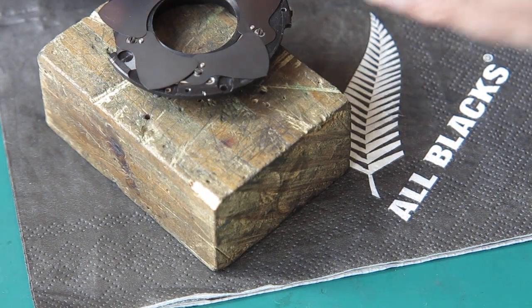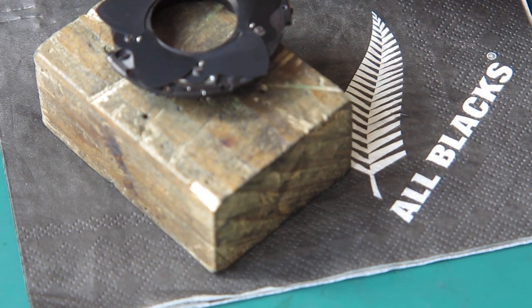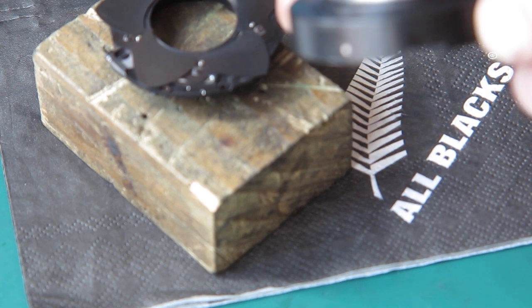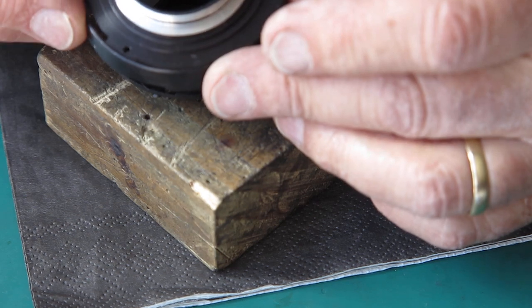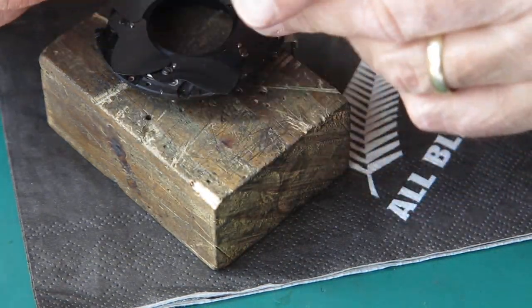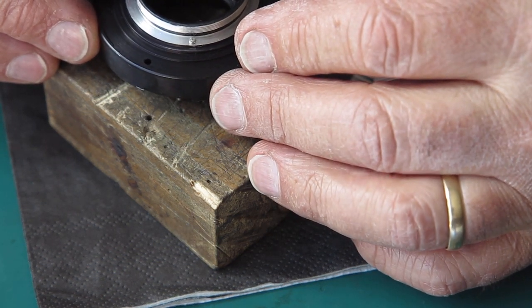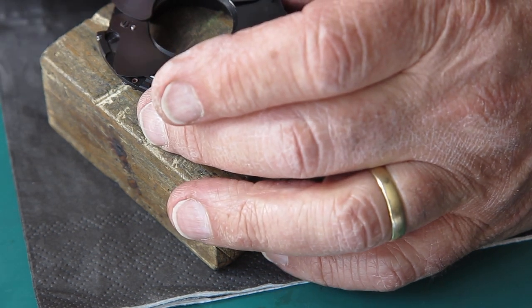Now I've got to get my shutter case, which I've cleaned, over the top of this and screwed into place. So I'm looking at the spacing of my mounting holes, and they're not symmetrical, so it only goes on in one position. My flash contact is going to be over here somewhere, yeah, about there. So I'm fairly sure it goes on there. Oh, is that going to disturb my shutter blades? It flaming does. Okay.